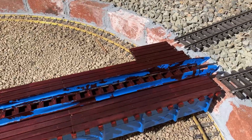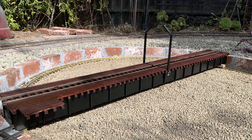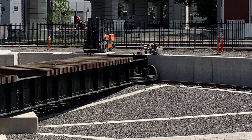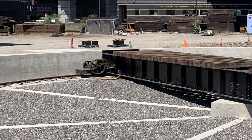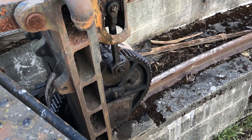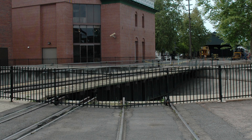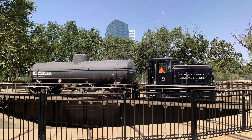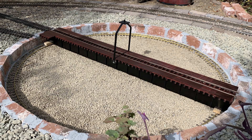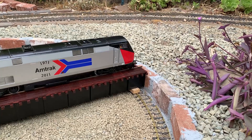The next steps are to fit the center bearing slip ring connector, which will have all the contacts for the motor and track. Then I have to make the motorized guide roller — there are four guide rollers total, one in each corner, and one of those will be powered. I'm planning to use a 60 RPM motor, which will result in it moving pretty slowly since it's on the end of the bridge — at 60 RPM it'll be creeping along, which is fine. I don't plan to have any indexing controls; it'll move slow enough that you can easily line it up with a track. It's basically going to be 12 volts DC, reversing polarity to switch the motor direction. Track power will be fed through the slip ring connector.